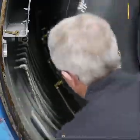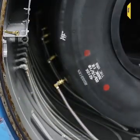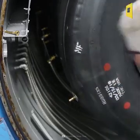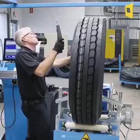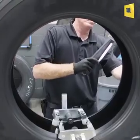The pressure is released after completing the curing process. Checks are made for separations, repair quality, liner blisters, splice, and overall appearance.